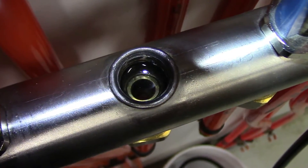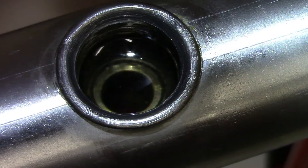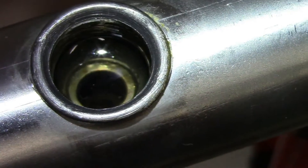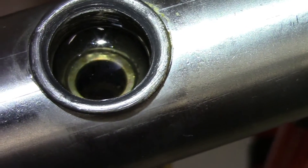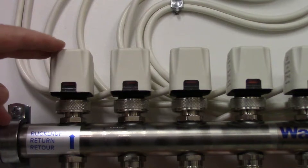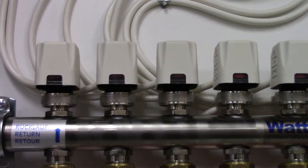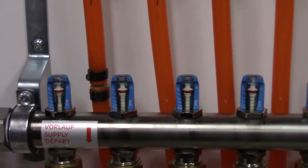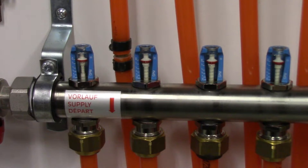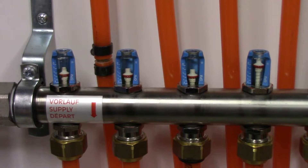Just in case you're wondering what the inside of the manifold looks like where those flow valves are — I was thinking maybe there was gunk in there making the disc stick — but as you can see it's pretty much spotless. The fluid is really clean and the little brass outlet is clean. Nothing that would cause it to stick. The actuators are warming up now; you can see the red window moving up on the ones calling for heat. There's a micro switch in one of them that signals the boiler to fire up and turn on the recirculating pump.